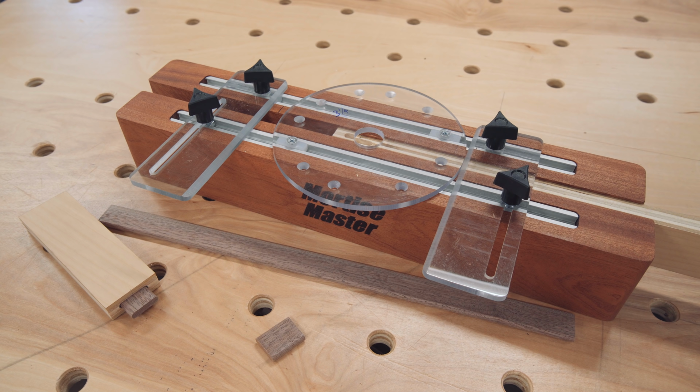But anyway, this is two setups, or three setups I guess, for bringing the material to the jig. You can also bring the jig to some material. If the piece isn't in a vise and you're bringing the jig to the piece, then it's even more convenient because gravity is working in your favor. You're setting something on top of your material rather than trying to set something up into the jig. So gravity's in your favor here.